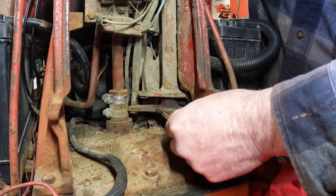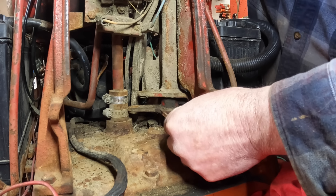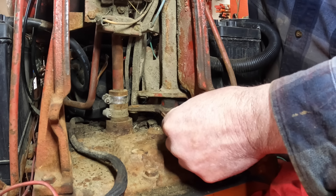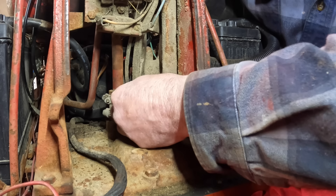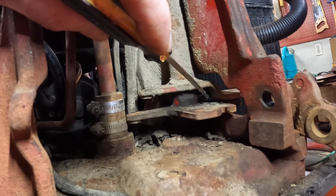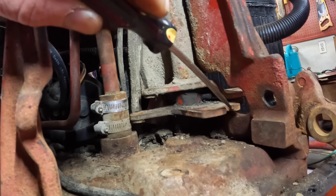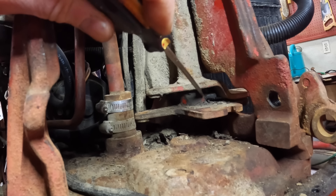Hey, look at this — I am holding the top of this rod in place. It's not supposed to do that. When I hold the rod on the other one and try to turn it, no can do. Something's wrong. It's that right there — see that spring pin sticking out? It's worked its way out, and it's probably egged out that hole. Oh, that's not going to be easy to fix.